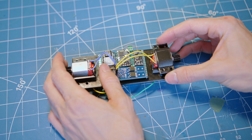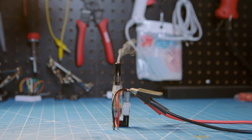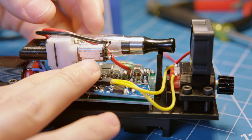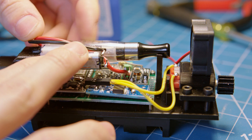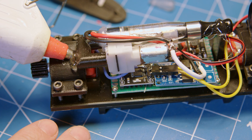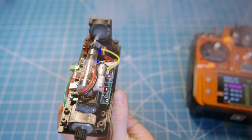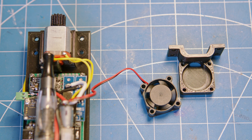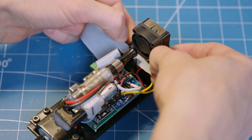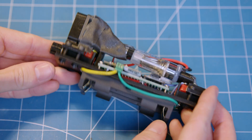Size and weight were major concerns, so I had to find the smallest form factor for every component. While I considered building a vape atomizer from scratch, a completed assembly caught my eye since it included a small pump to drive air through the atomizer and out the top. I made a small stand and glued the whole thing in place. To turn the smoke on and off I wired everything to a MOSFET trigger connected to my transmitter, allowing me to safely control power to the heating element and fan simultaneously. I then made a fan shroud with a small opening lined up exactly with the exit vent on the lid, and applied gaff tape around the fan shroud and vape cartridge to keep any remaining smoke from leaking out.